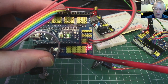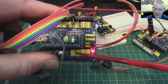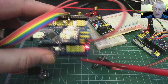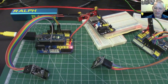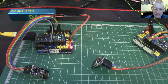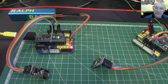These clone development boards have both pins and sockets. The pins give you D0, D1, D10, A7 and so on along one side, with 5V and ground right next to each one, so you're never going to run out of supply pins. That's why I like these — they're as big as a Uno and make everything much easier to use.